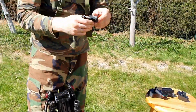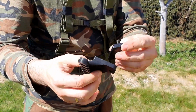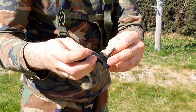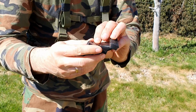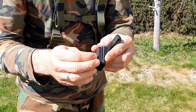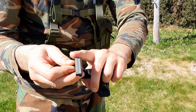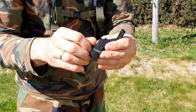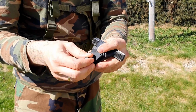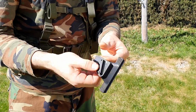So we have this extra detail that we are offering you, and then you already have this bottom fixator, and you can assemble it easily. You just have to put in 3 screws and then it becomes one part. So pay attention, you might need to remove some surrounding brim here, just filing it a bit if it's not fitting perfectly, but we have tolerance of 0.2 millimeters here for your convenience, but if it's not fitting, just file a bit the margin. Here also you can get this part fully assembled if you like.